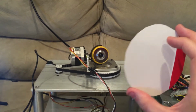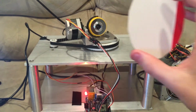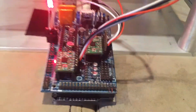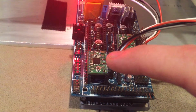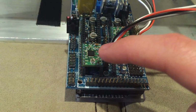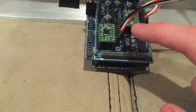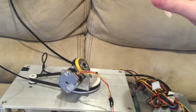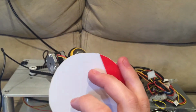The x-axis is a little twitchy right now because the motor shield comes with five different stepper axes you can put on, and it comes with 5 of these little circuits here. They're called the drivers, and they do all the electronic stepping of the motors themselves. And out of the 5 of them, I only have 2 left, and I think the x-axis one is going, which is why you can see the web camera Y is a lot more responsive than the x-axis, which moves really slow.